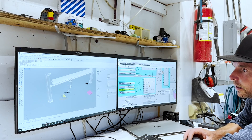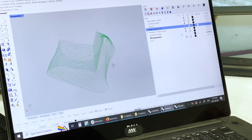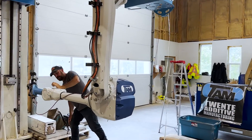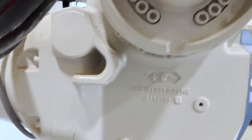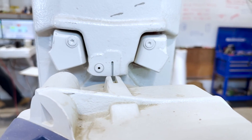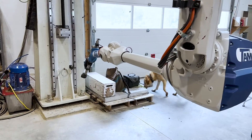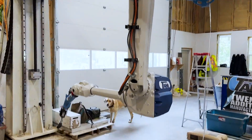Now let's jump to the design that I got to print. One object was based on the LiDAR scan of a tree trunk and the other was just a simple circle. For the print, you check the orientation of the printer by setting all the points to zero and then checking if the lines align. You can see the line on this side matches up with this point when you look at it straight on, meaning it's properly calibrated. Each joint has a similar line on both sides, and when you have all six joints lined up, you're about ready to do a dry layer test.